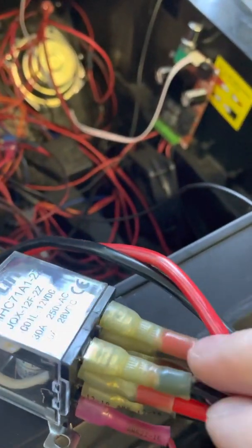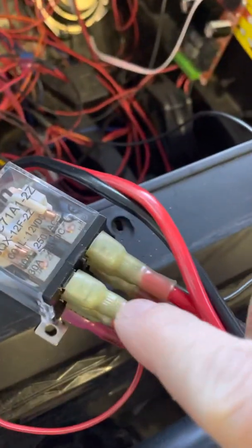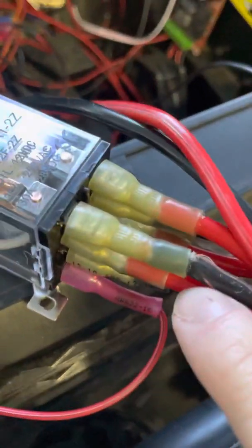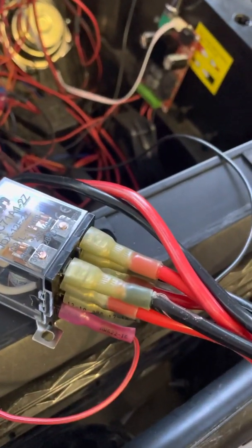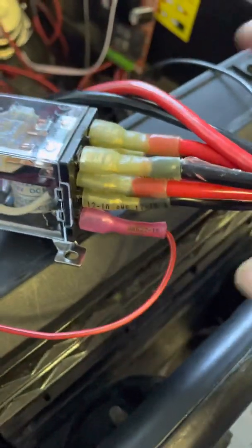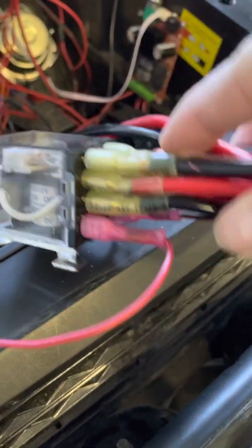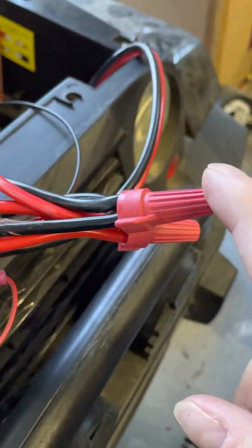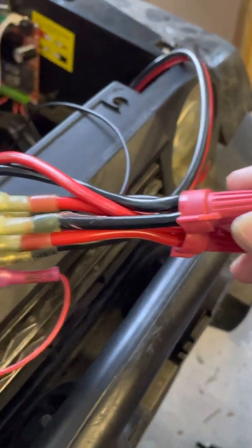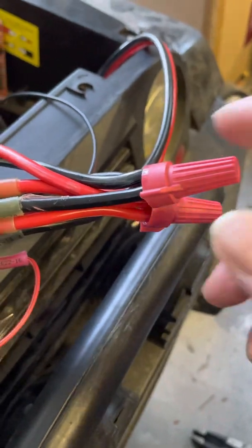This is the output to the actual motor. We have the top, which is black and red, and the bottom, which is red and black. That's the switch — that's forward and reverse. This switch is these bottom two that controls whether the electromagnet is activated. I've connected these with wire nuts — way better than messing around with solder or weird quick connects that can fall out. Just twist them on and they're good.